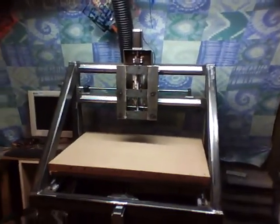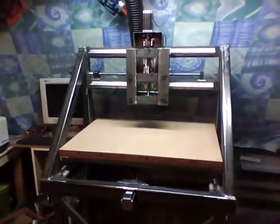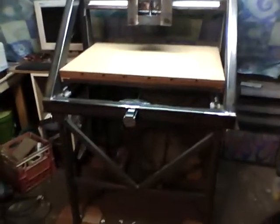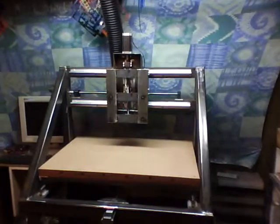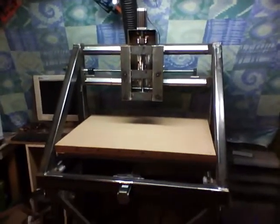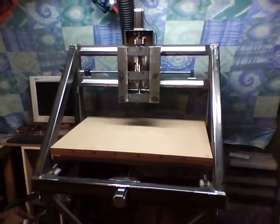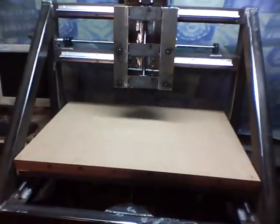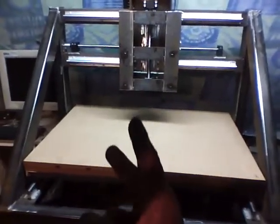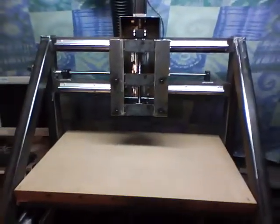Now I've got wiring to figure out, stop switches, probably one more round of adjusting all the glides and blocks and bearings, and then final squaring up of the machine. It is in the house, just about done, and bolted to the floor and ready to go. The next video will probably be milling material. The sliding table — that was the way to go, that was smart. Building the whole machine twice — not so smart. But the second time, when I did get it right — smart.